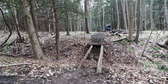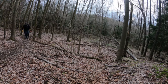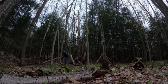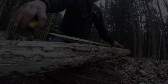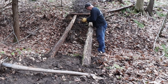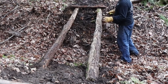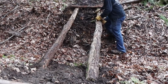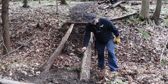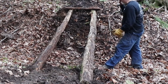I'm going to use some of the pieces from the old bridge and cut some deadfall up to make new ones. We want to remove as much bark as we can, because the bark holds moisture which leads to rot. It should fall off on its own as it rots enough. The less bark you have, the longer these are going to last out here. Just being up in the air actually lets air circulate around it, so it's going to last a few years.